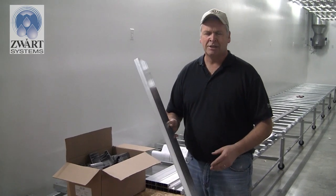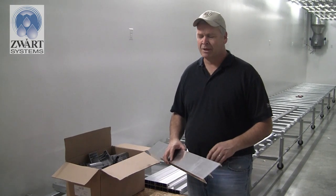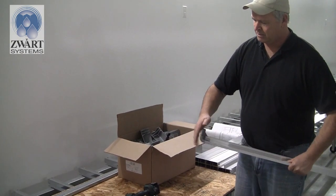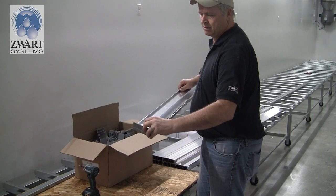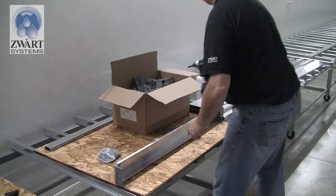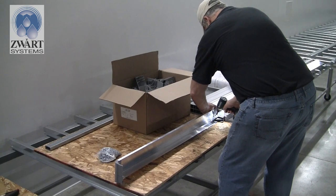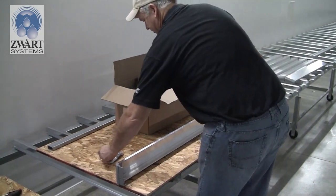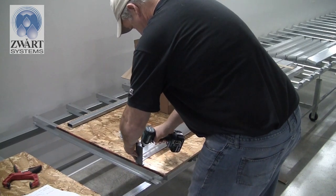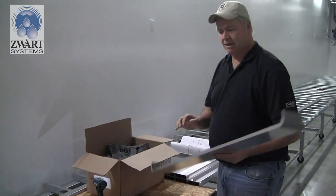The side profiles will be pre-cut just shy of 48 inches. Put the corners on — they come in a box and just slip into the ends fairly snugly — and that brings you to the 48-inch OD measurement. Now you have a finished end board assembly.